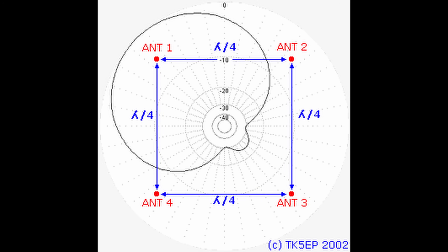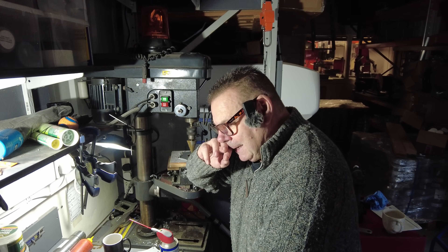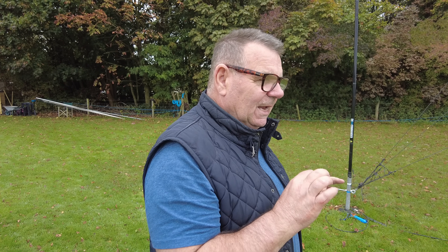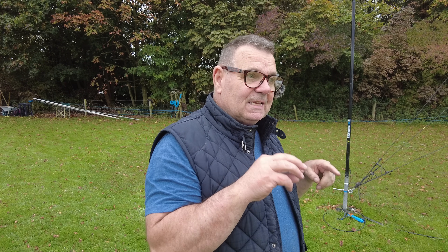If I'm facing America — northwest-ish — that means southeast I shouldn't be able to hear almost anything. The front-to-back is about 30 dBs, it's very strong. The book says you tune down the lowest SWR route, however that is not accurate enough. The most accurate way is with a fancy meter looking for X, the reactance, and getting it as near zero as you can for the particular frequency you're trying to tune for.